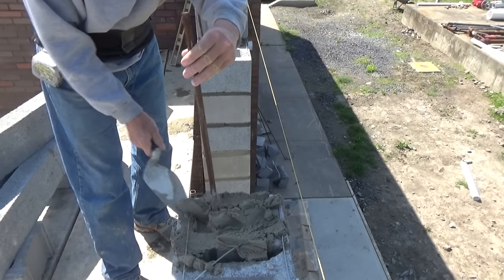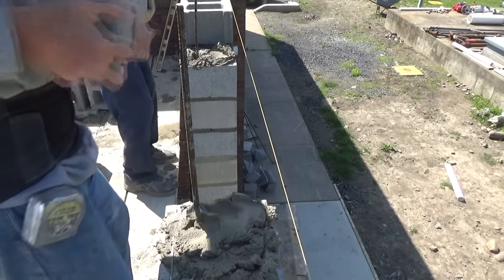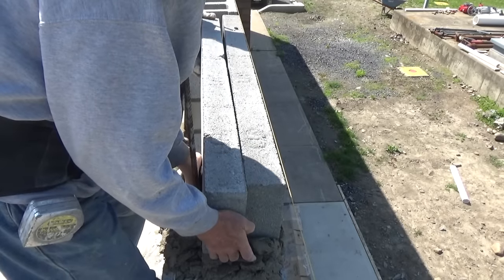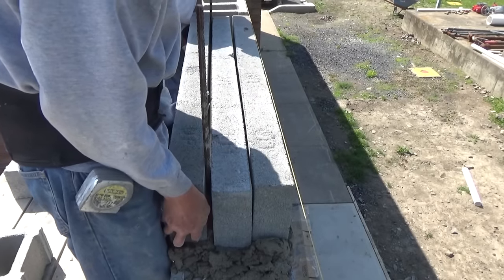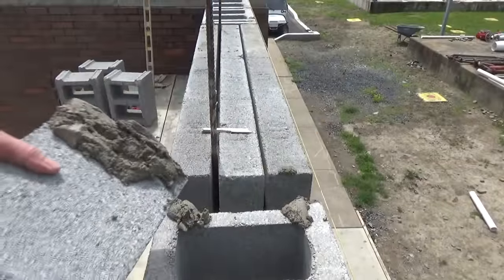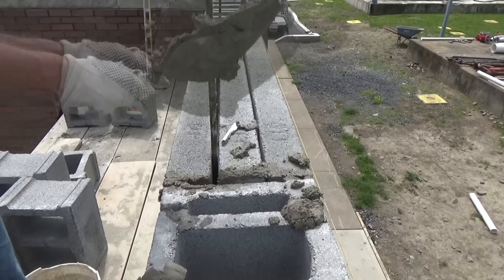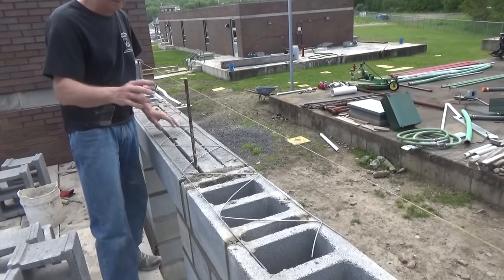They're all filled. This one is movable — I did that for a reason. It's gonna pull out, pick it up — beautiful. The last one should go right up against there. We have our lintels laid. What's really important is how level underneath it is — that's a big deal. Just fill it in to the side wherever it goes. I'm putting some DuraWall right here to go over the top of it, and I've got to run my course right over it.